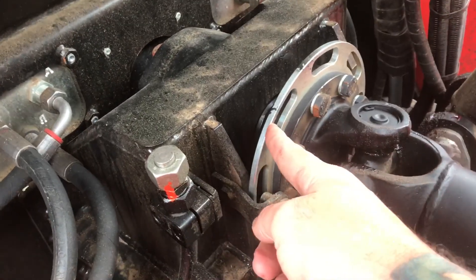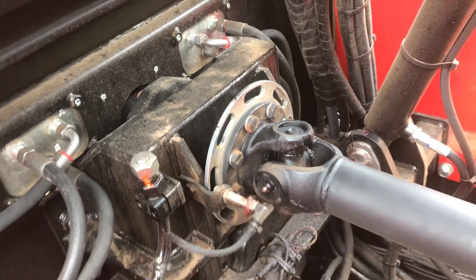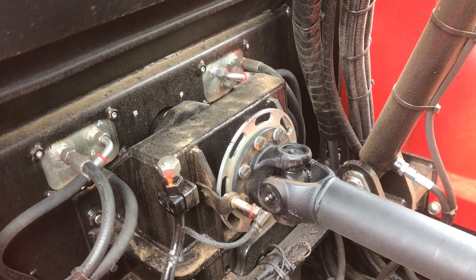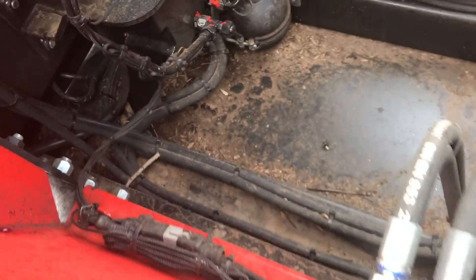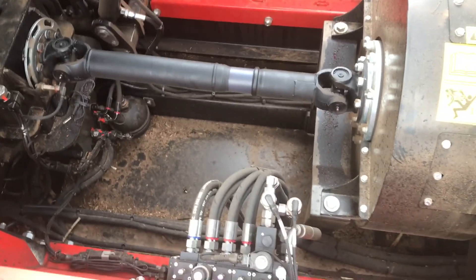This nice little ring here is something you can't usually have on a hydraulic machine — that's a pickup ring. So you can have a tachometer to know how fast your operation is running. You do have a hydraulic valve block there for some functions and a little bit of wiring. But in the grand scheme of things, it's pretty basic underneath the cab.